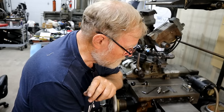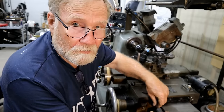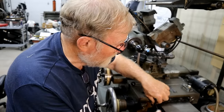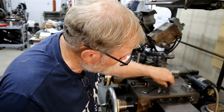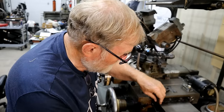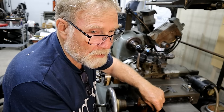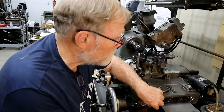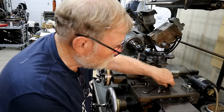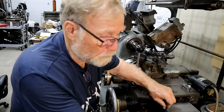Now the Beast, the 1943 Rockwell hydraulic planer, has way wipers also. And I don't think they got changed very much either. Because you can still see some scoring in the ways. But I'm not going to mess with them because it's not that bad. Still is an accurate machine. Now I changed all the wipers. I took some half-inch felt and put in there.